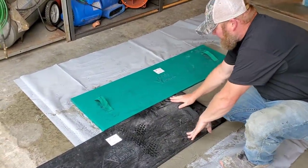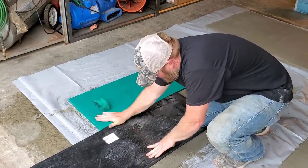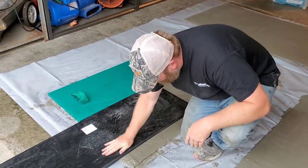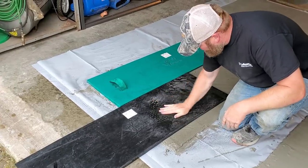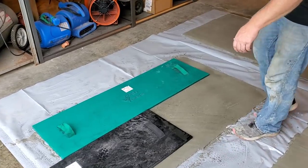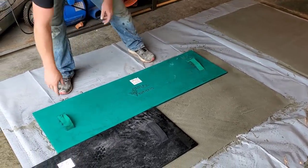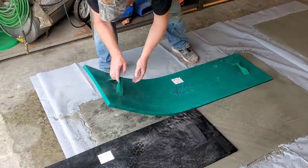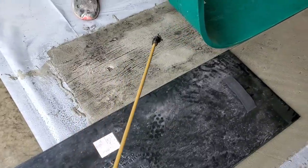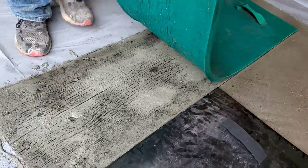So we're offsetting our seams. Normally on a big job, we'd have a whole pile of these stamps and just cover the whole thing in stamps. With just two here, we're going to pick one up and set it over to complete the board. The good thing with liquid release is when you go to pick the stamp up, you can take a peek under it and make sure you've got good texture — if not, you put it back down and tamp it a little bit more. That's the difference between liquid and powder release. With powder release, you just don't know sometimes. If it's sticking, we just spray on a little bit more.